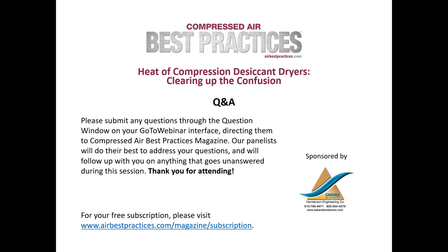Okay. This next question is for Mr. Van Ormer. The question is, do all heat of compression dryers have the ability to switch to heatless if required? No, that's an option that's available from the manufacturer. So you just have to check on it, whoever you're talking to, and see if they have it. I know that Henderson Engineering has it in theirs, and it's doable on any dryer if you've designed it.